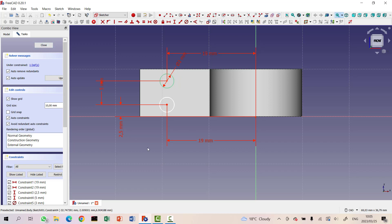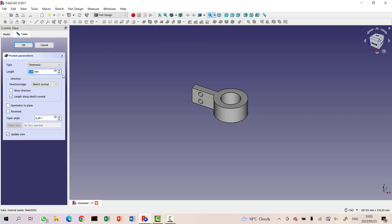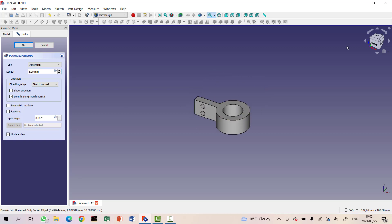I need to make sure these two hole circles are equal. Now we are set up to get the holes through this thing. Let's close the sketch and pocket it — just straight through. It's 4 millimeters thick so the hole goes straight through. We can turn the part a little bit and see that the hole goes straight through.